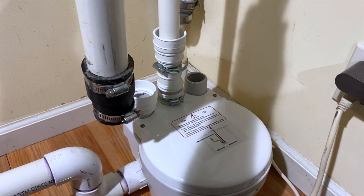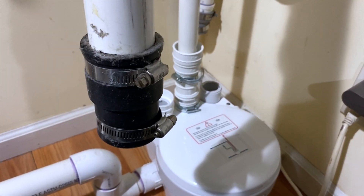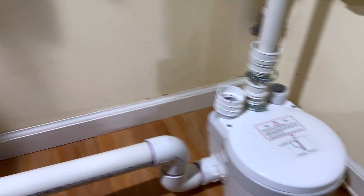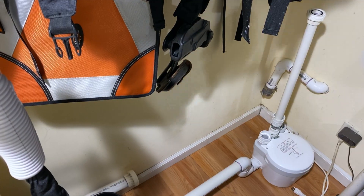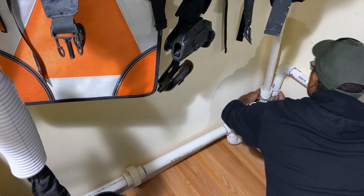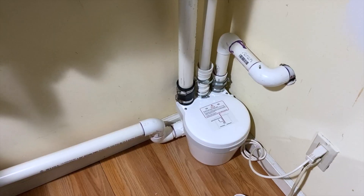I have that also set up with a couple of union fittings. I'm not going to use the new vent pipe — my existing ones are still in excellent condition so I don't need that part. I'll continue setting that up. This is simply discharging the gray water from my washing machine and my utility sink — it's not a heavy load, and that's exactly what this pump is made for.